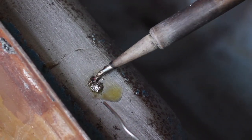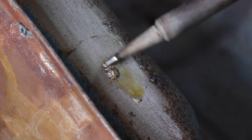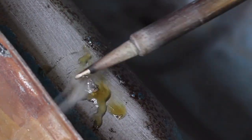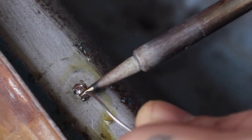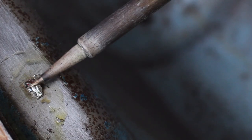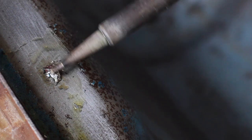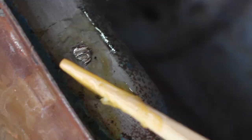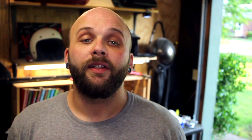As I mentioned earlier, I've never done this before, but I have soldered things like wire and PCB boards and other electrical components. Working on metal was just a little bit different. This solder behaved a little weird once it hardened — when I tried to melt it again, the iron really didn't do anything, and it just kept ripping the bead I had already made right off the tank. The trick that worked for me was using a lot more solder than I thought I needed, as well as more flux, and eventually everything flowed really nicely and filled in the hole perfectly. Next, I just sanded it down flush with the tank, and I'm good to go.